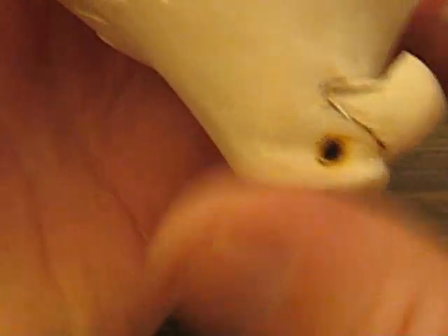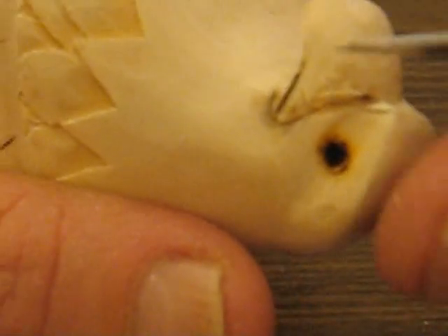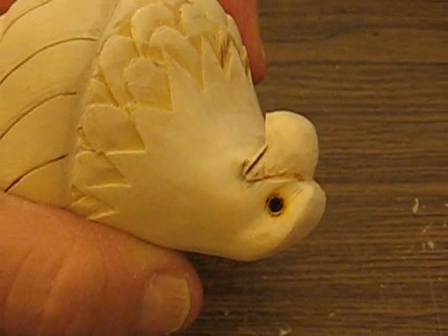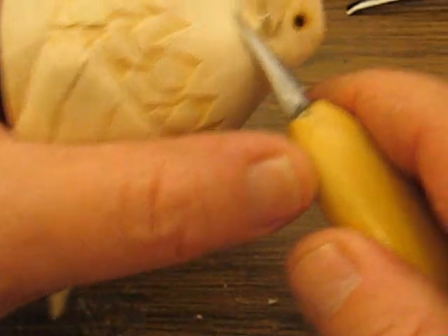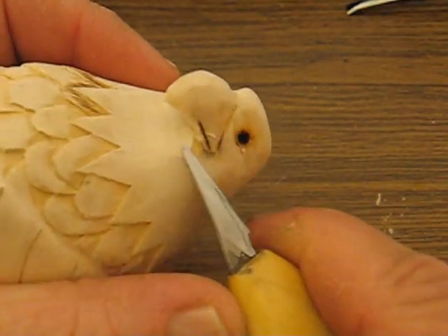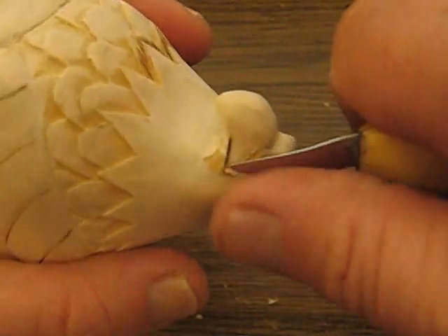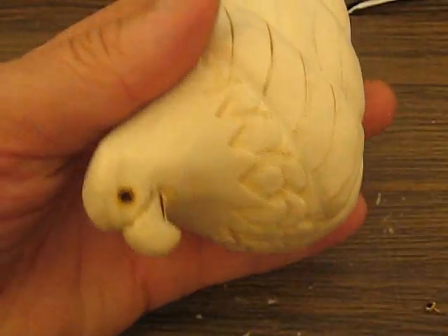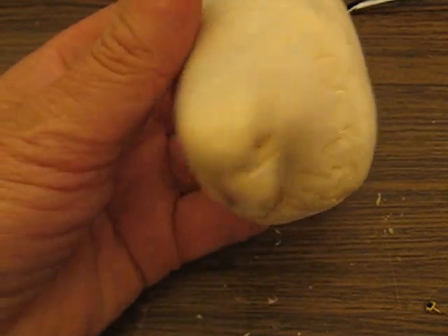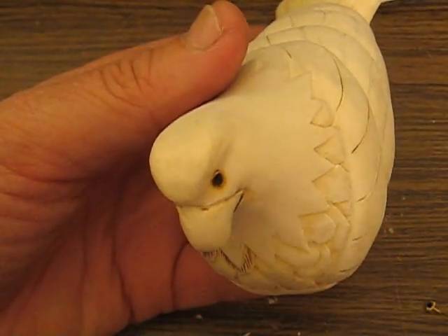We're going to have to re-sand some of this, but you want to make a little bit of a ridge right here, just like so. What you want to do is cut that out and follow that all the way around and underneath here as well. Just like that. This is really going to be indented, or pushed inward, just like it is here. You're trying to get the same look on this side. I'll finish the rest of that offline where I can get to it a little bit easier. It's a matter of just putting a stop cut where you want it. I used the wood burner to do the stop cut.